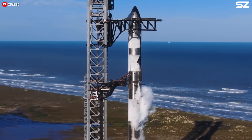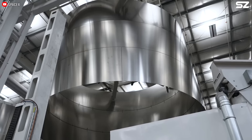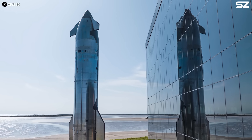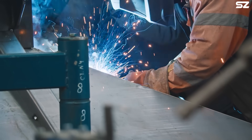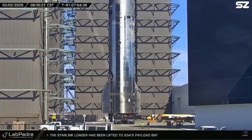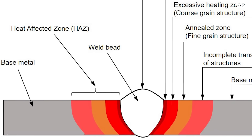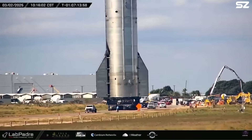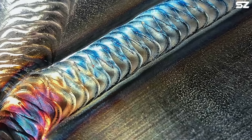Well, not really yet. While stainless steel offers compelling advantages, it does present its own challenges, particularly in terms of welding. Stainless steel retains heat exceptionally well and has a higher rate of thermal expansion compared to mild steel and aluminum alloys. When exposed to excessive heat during welding, it can warp and distort as it cools. Additionally, stainless steel is more prone to developing heat-affected zones (HAZ), which can compromise its corrosion resistance and weaken the weld. To tackle these issues, specialized welding techniques and filler metals are required.